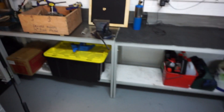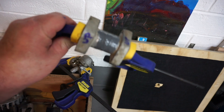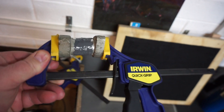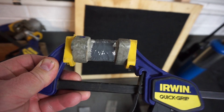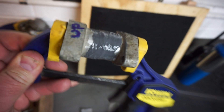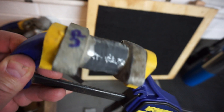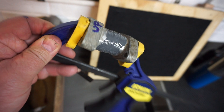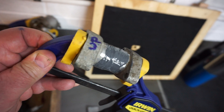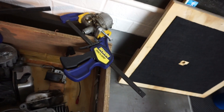One of the biggest problems I had was the intake manifold — I had to cut and shut it. I don't have an aluminium welder, so what I did was cut it off on my bandsaw, milled it flat, put it over on my linisher. I did a bit of a V-groove, like a V butt weld, but instead of using weld I just used JB Weld. That's in there curing at the moment.